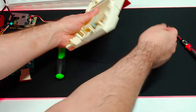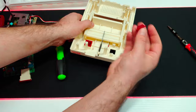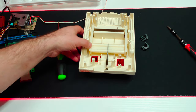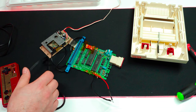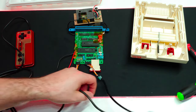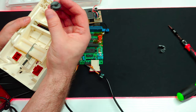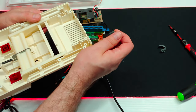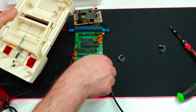The next piece is going to be these buttons — just make sure the reset goes here, and it doesn't seem to matter which orientation it goes in. I'll set this aside for now because I have to reassemble the controllers and reattach them: player two, player one. It's going to be very fun rerouting these cables — they are kinked in the right places where they route through the different channels and around posts. We also have little grommets here to protect the cables from the sharp edge of the shell. They'll all have to be routed.